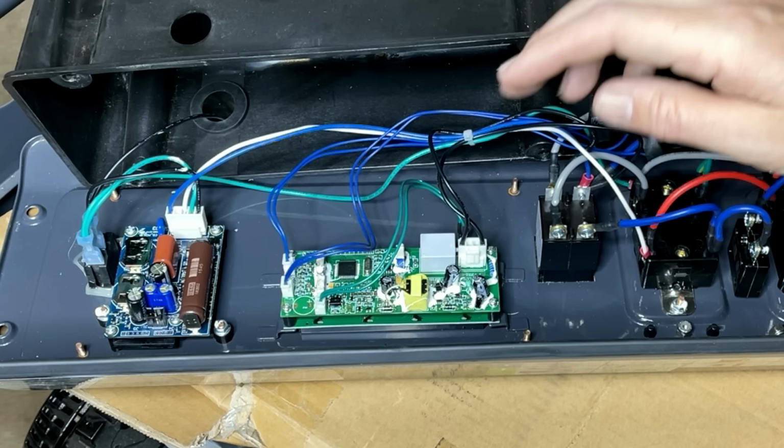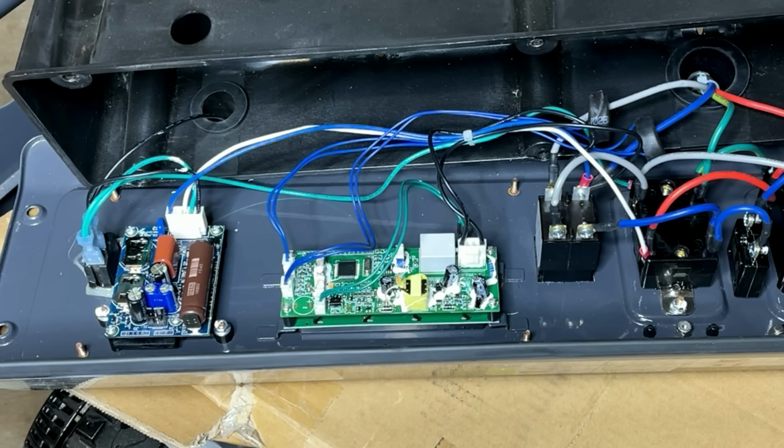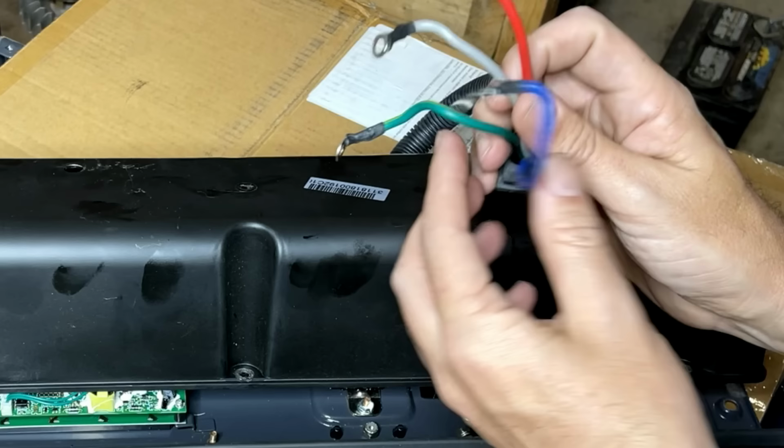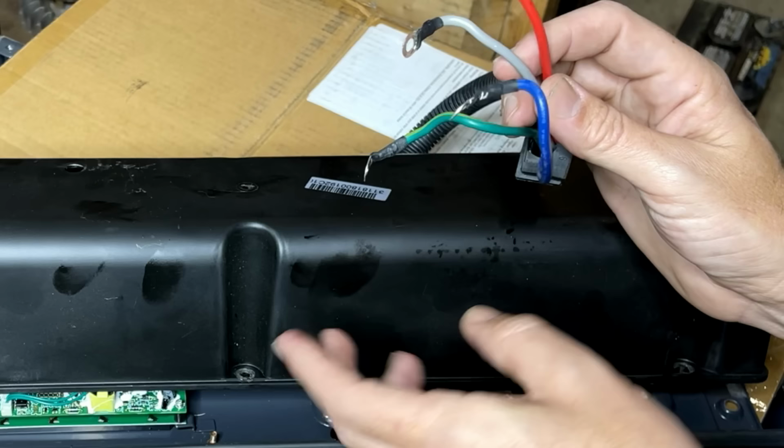But, you know, this here, everything looks in order, so I don't think we have an issue there. But as one final check, I want to check the actual wires here. None of them should be cross-connected. I have a feeling, because these boards are in circuit, that we are going to read something. So if we do, we'll isolate it, take those boards out of circuit, and just double-check it again.